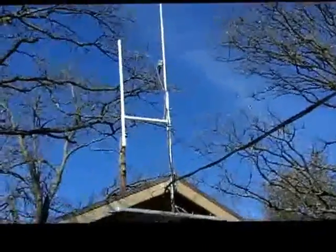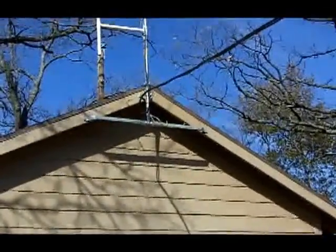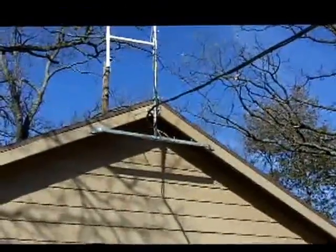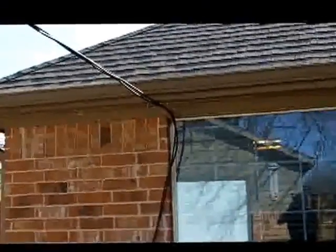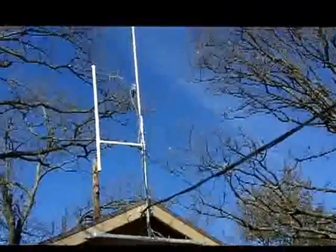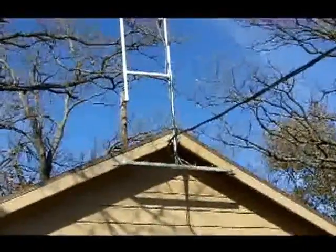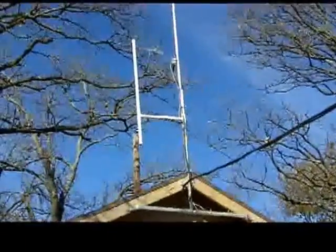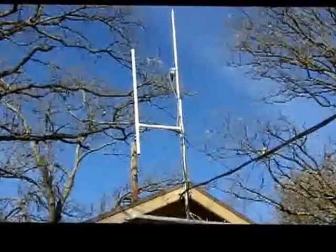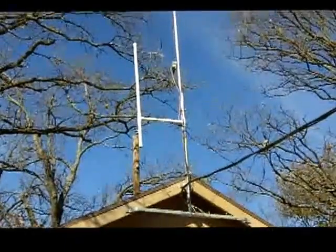I've shown this before in other videos but I want to show it again. My radio club helped me install some of this. We ran a messenger line — a stainless steel wire between this building and this building right here — and then tied the coax to it, to keep it up nice and high above the ground. You can see I've got a Comet GP9 dual-band vertical, 17 feet tall, which I use for VHF/UHF. The little antenna on the side is just a backup — not really connected — but in case this one fails I can connect the smaller one up and still remain on the air.